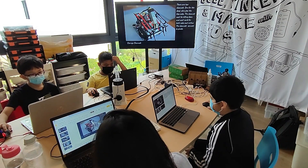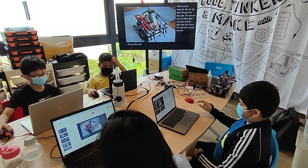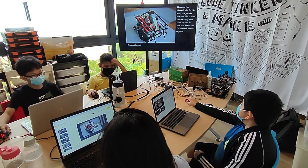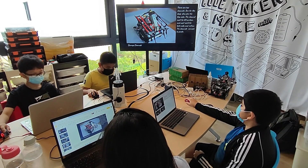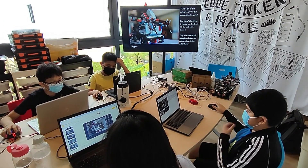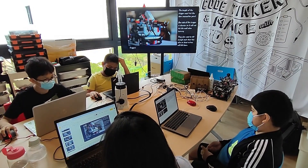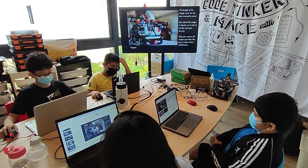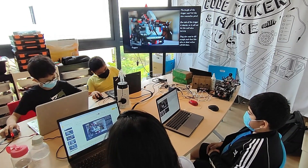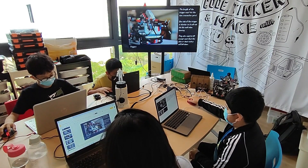Next, we will be talking about the storage channels. There are two channels — one for the dead victims and one for the alive victims along with the blue cube. When building, we had to make sure that the channel was tilting down and must work for both cubes and victims. The channels connect to a pivot. For the triggers, we had to make sure the length of the trigger was 6cm or more. We also made sure that one side of the trigger is shorter so that it would not hit the wall of the evacuation zone when turning. Lastly, we made the triggers such that the alive or dead victims will slide down the storage channels.